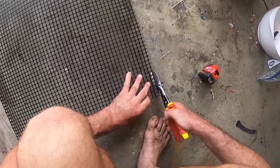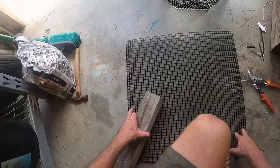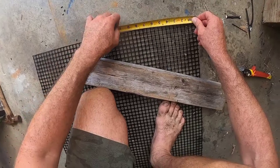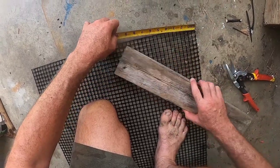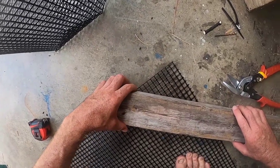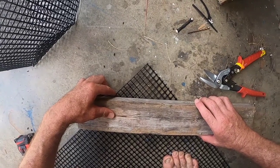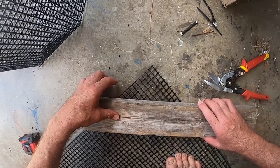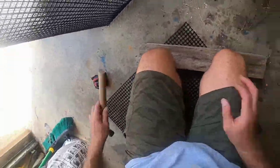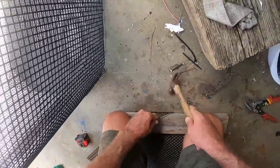When you cut the material you're going to want to get all these little sharp nubs off and re-cut it. In the corners here to make your 45s — I do five inches, you can do whatever you want. Put your two by four in there and then follow your little squares across on the 45. So both sides of this corner is five inches from the corner. Put your knees on it, get your hammer, bend up on your material and then whack it over.